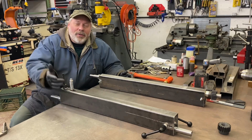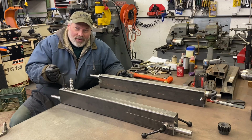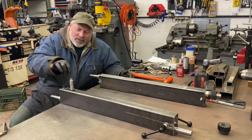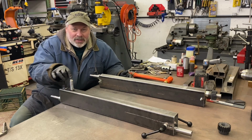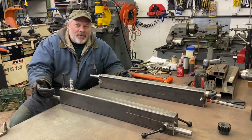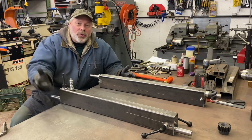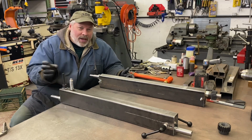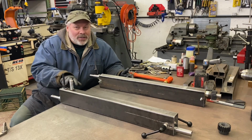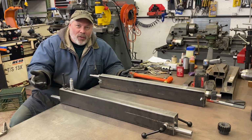The springs, I was so impressed. They had at least 12 drawers of different springs. My only criteria was I knew I was going to have a 3/8 stud coming out of my floating block, so I wanted them big enough if I ran an inner and an outer, which is what I currently have. So long story short, I bought a couple 3-inch springs. They have more. I could go back and get stiffer ones, but if I run just the outer, oh, and the washers are just from the drawer that said finishing washers.